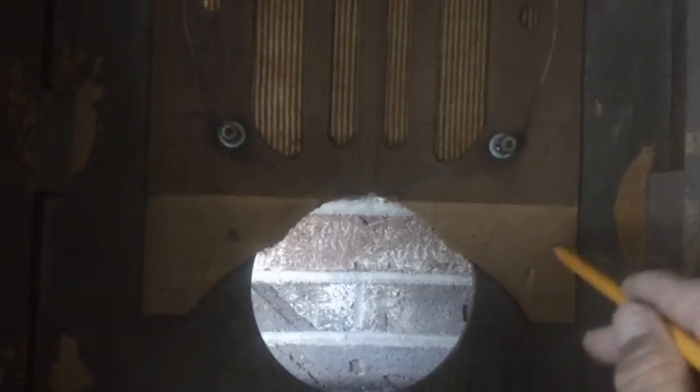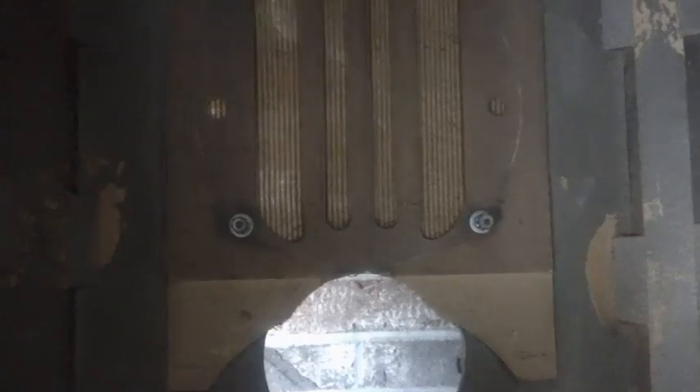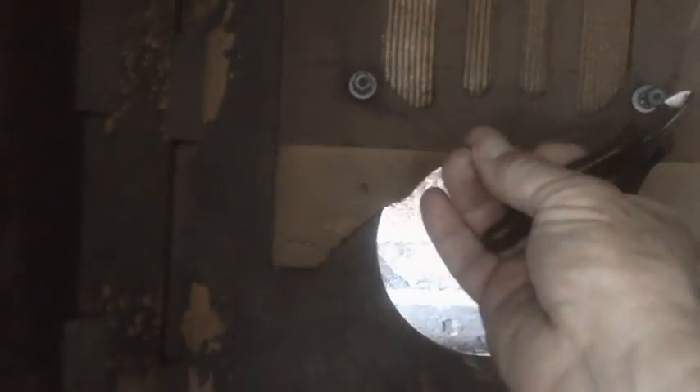This speaker support appears to be stapled in only two places. Normally you're stapled at the bottom, sides, and sometimes the top. These cardboard backings get really brittle over the years — the slightest touch and they begin to flake apart. People really destroy them sometimes, just trying to get the speakers out. Let me show you a quick and easy way: use diagonal cutters. You can snip off each side of the staple so two little stubs stay in, and the whole thing lifts out.